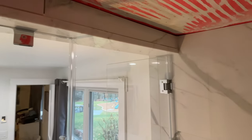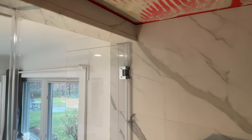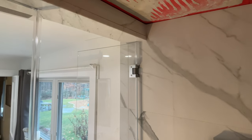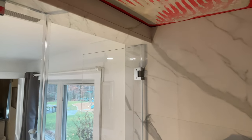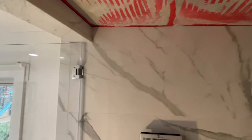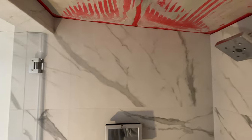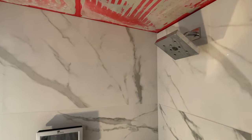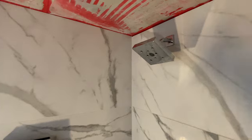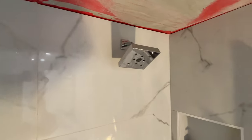The bulkhead is super important because it creates a buffer between both rooms, and I think it looks better than having glass all the way through the ceiling. How do you finish a sloped ceiling if you don't have the bulkhead? This is the proper way — I've done a ton of research on this over the years, I've installed a few steam showers. If your contractor is doing a flat ceiling in your shower, you have a problem, because you're going to have that water dripping on your head. Now we're going to tile it all up.